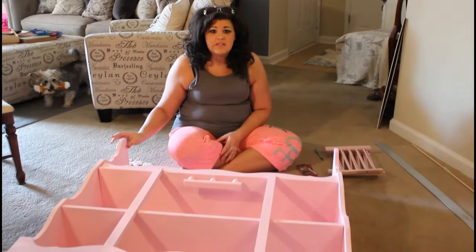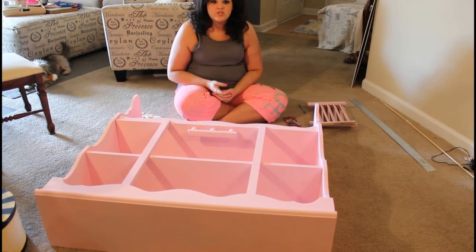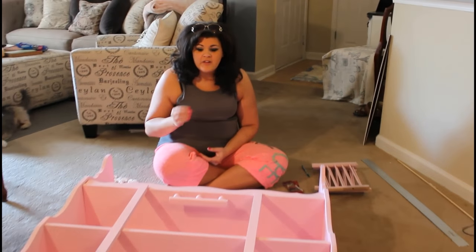We're back and I'm officially done painting my china cabinet. I think it turned out pretty great. This actually ended up needing six cans of paint, which is quite a bit. I feel like the reason it needed so much was because I used the gray primer. If you don't plan to create a distressed look on your cabinet, I would use a white primer instead. But because I plan to scuff it up, I want some of that gray to show through on the scuff spots.